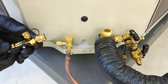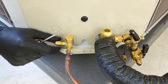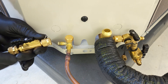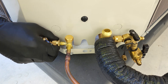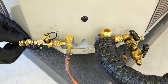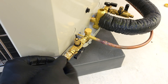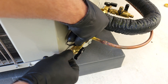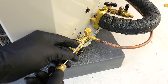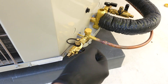I like to put them right on the top of the unit. On this side, I could unscrew my stem and take the valve core out just with this tool, but in this case I'm going to take it out by pulling the valve core through the tool. You pull that rod out, mount your tool onto the port, then push your stem in until you feel the tool stem grab the valve core. Then you unscrew it counterclockwise until you hear a clicking - it's off the thread. Then you unscrew this and you have your valve core. You want to remove these because you don't want to be pulling a vacuum through the tiny little hole at the end - that would be a major restriction and would slow it down very much.